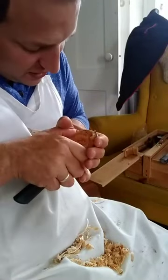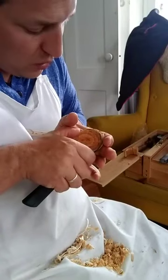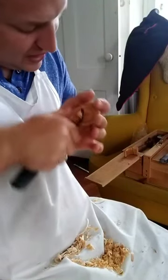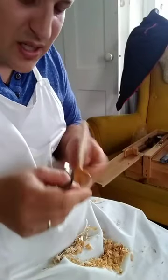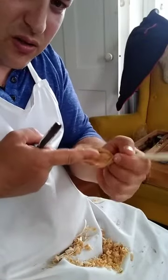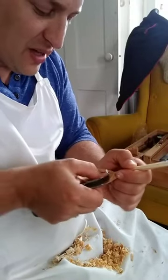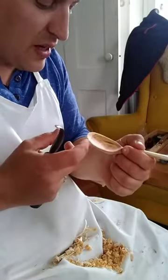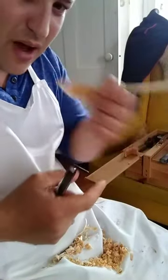All right, so now I'm blending, and you'll notice I'm blending by going with the bowl. For whatever reason, with cuts in this way, you don't notice the ridges in the same way because the spoon interacts with your mouth in this direction. You're not putting the spoon to your mouth sideways. And so facets that run this way, your lips just don't feel. Whereas if all of your cuts are going across, you're creating a bunch of ridges and your mouth is going to feel it.